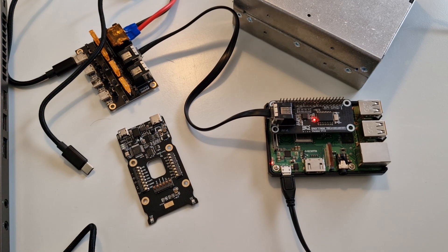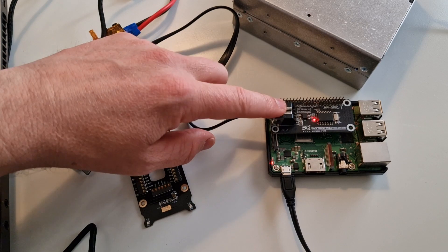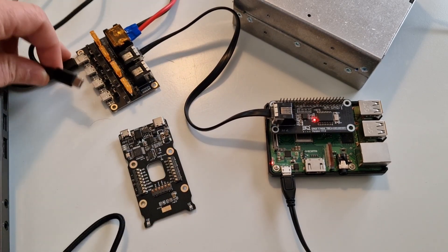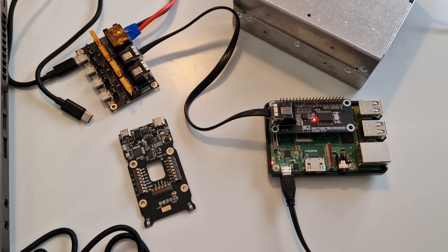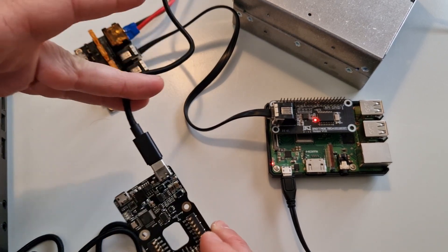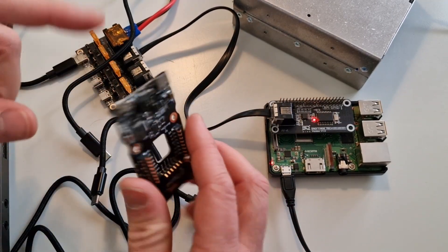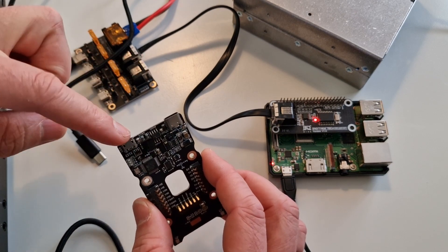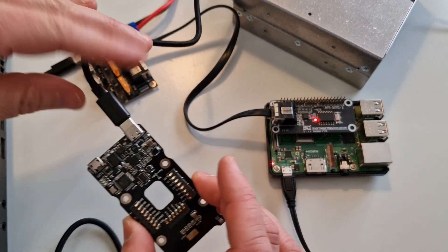A couple prerequisites — we'll start with the hardware. The Hermit Crab CAN system comes with quite a bit of things: the Raspberry Pi hat (a Big Tree Tech version) for CAN bus distribution, all your cables including regular USB-C to C and a Micro to A type USB, your tool hub system, power cables, and the tool changer stuff. What we're going to do is install it using only the one CAN system. With the CAN setup, you have just this one cable and that's it — nice and clean, easy to install.